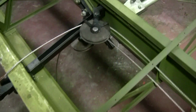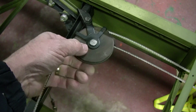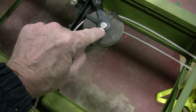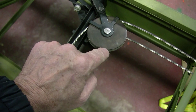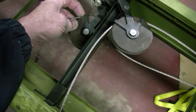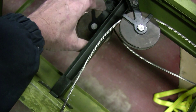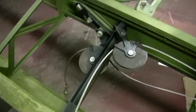Here are the pulleys. I've taken the time to pull these pins out, clean the inside of the pulleys, and inspect them — they're good to go. Here's the bottom one as well; same thing, we pulled that out, cleaned it, and inspected it, and put brand new cotter pins in the bottom of it.